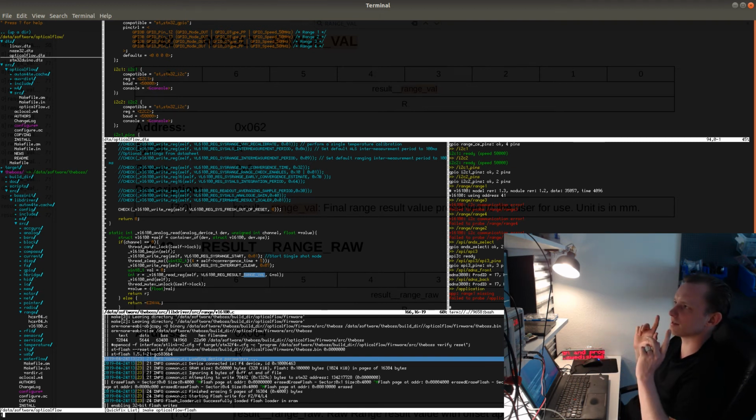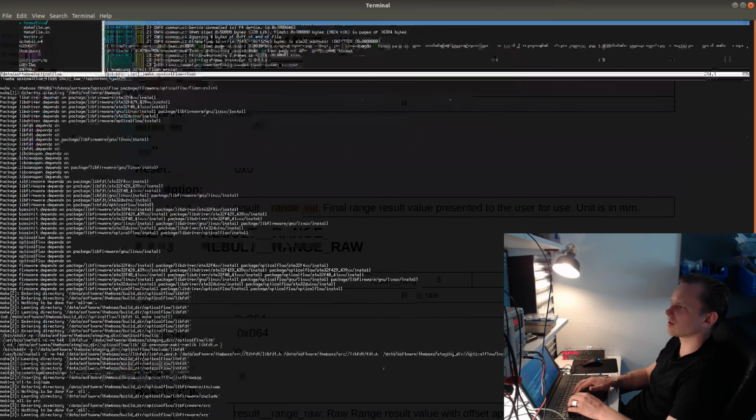It's important to initialize the GPIO pins to be low while configuring each device one at a time. And then once the device is configured, then they can all be on at the same time, once all of them are configured one by one. Or actually, as soon as the previous one has a new address, so that it won't accept commands going to the default address, then it can be left on while talking to the other sensors. But at startup, they should all be off.